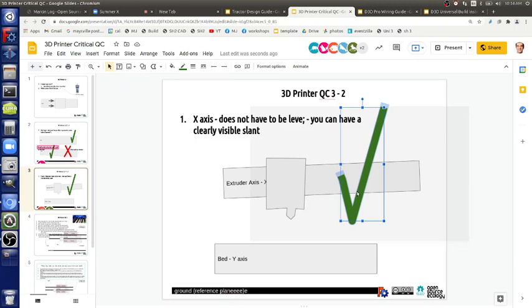Layer height? No, the initial adjustment. The way we do this is we run the printer the first time and observe how much we have to change the Z height with the knob, because your probe detects the height. It'll get you close, but up front you don't know how far the probe is above your nozzle, so you have to find that out for your prints to be accurate. So the first step is you turn the knob. There's this thing called baby stepping correction, the Z correction. You turn the knob a few millimeters up or down until the print is exactly at the surface. You record that number and store it in memory. So the question I'm asking is, how accurate does that number have to be? What's the tolerance of this printer for inaccuracy on the initial Z height correction, the Z height leveling?